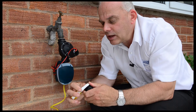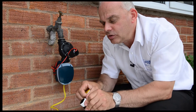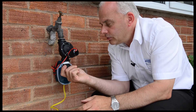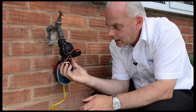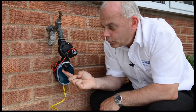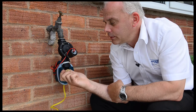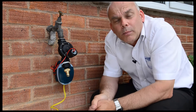You must use a bit of PTFE tape. We use the gas quality tape which enables us to seal it very quickly and efficiently. So we screw that into the outlet. And now we have a three quarter male just exactly the same as on the tap itself. And then we'll just screw in, in this case a quick coupling hose connector.